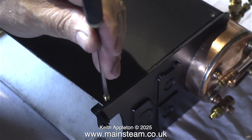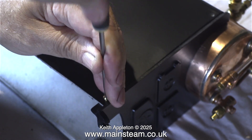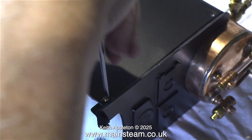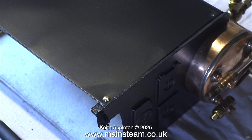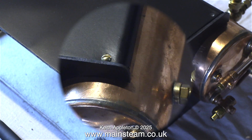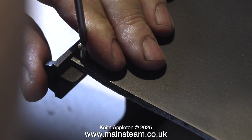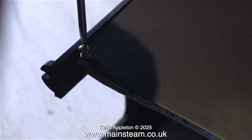I really am being careful that this screwdriver doesn't slip off the bolt head. It's really important not to over-tighten these bolts, because otherwise where the bolts fit will crush the heat insulation and make the corners of the side panels look unsightly. It's worth mentioning that the bolts at the top, where the boiler is, need to be shorter than the bolts at the bottom. If the bolts are too long and contact the boiler, that is a major problem — so bear this in mind if you're assembling a 504 boiler.